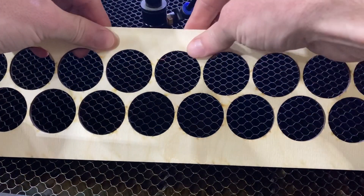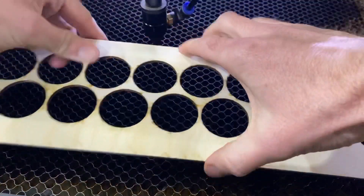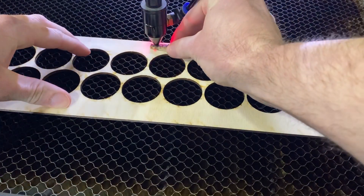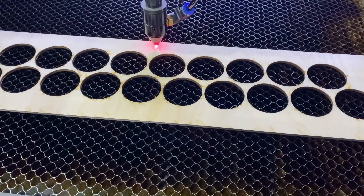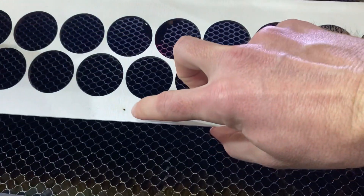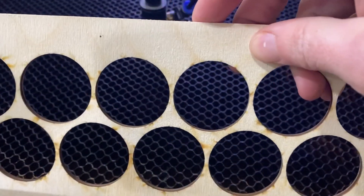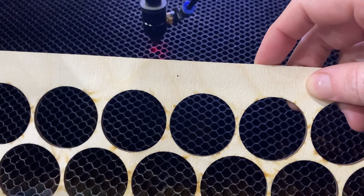As you can see it's nice and clean here and there's no holes on the other side. We're going to set this in here, check our new length — I'm right at my 5mm — and we're going to hit pulse, quick and easy. You can see that nice little dot, and it burned right through to the other side, nice and clean. If I hold it up to the light, I can actually see light shine through it.